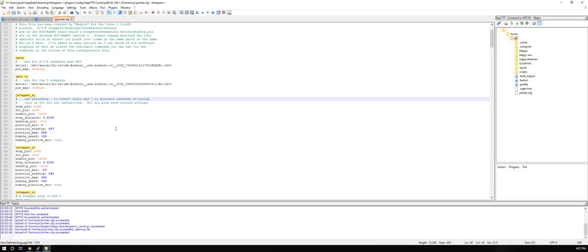If the pin has an internal pull-up available, putting in the caret, which you see right here in front of my end-stop pins, activates the pull-up. So that means the actual MCU pin is pulled high, and what we are doing with our end-stop is grounding that, or pulling it low. So when your end stops don't work, you need to try inverting them or doing a few other things. I'll show you on my machine, now that I realize I could just show you some of the stuff on my instance of OctoPrint on how to do some troubleshooting.